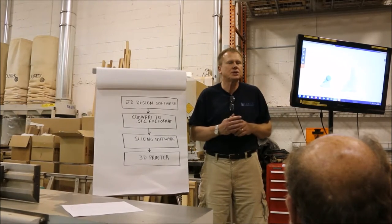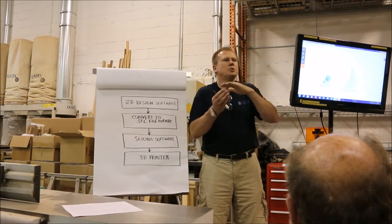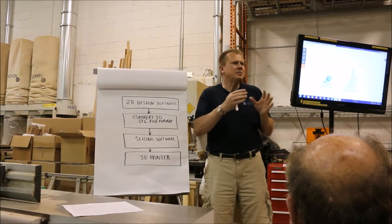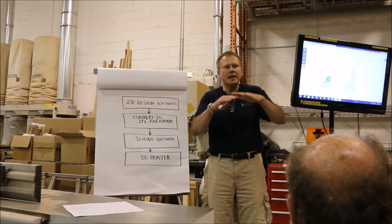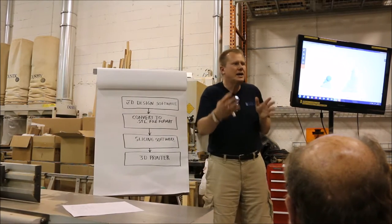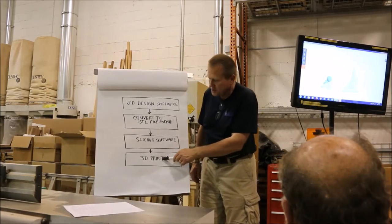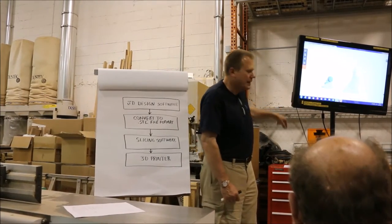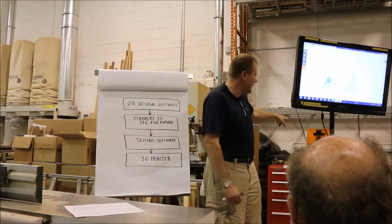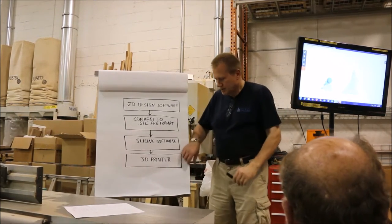The whole concept of 3D printing is taking an electronic 3D object and slicing it into multiple layers. The small parts we were doing here are about 400 layers. Each layer is made, then everything ratchets up a thousandth of an inch, you start over and do another layer, and you just keep building it up. The slicing software communicates with the printer itself, which has a couple of stepper motors — one Z-axis moving up and down — and a tray with resin that tilts side to side.